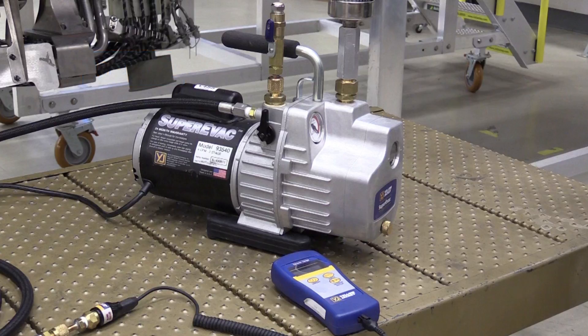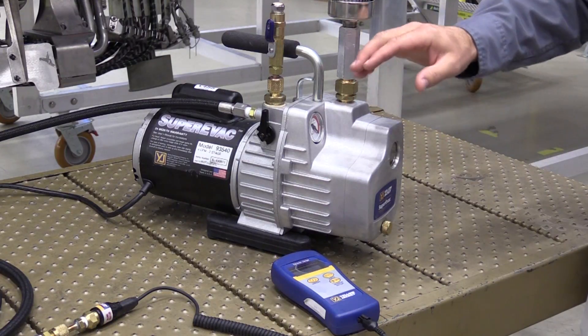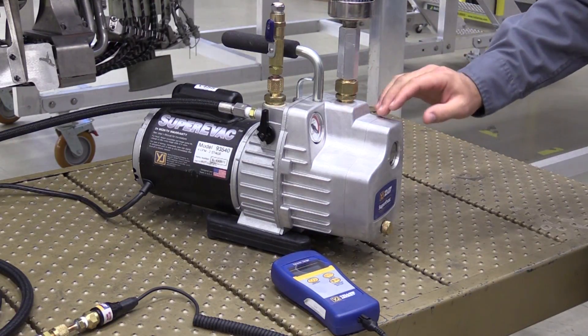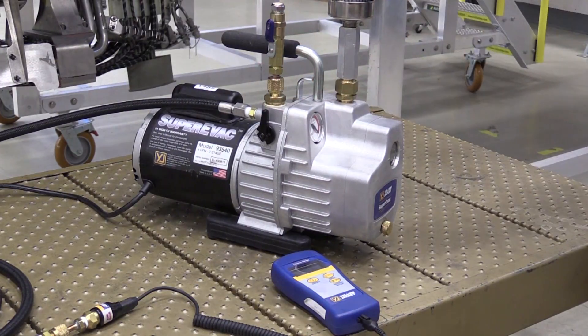To further explain the vacuum pump and how it works, we've connected the vacuum pump gauge to a hose that connects from the pump to the EEC PS3 port. This is for demonstration purposes only. The vacuum gauge is not part of the kit and is not required to complete this task. Prior to starting the pump, ensure both the blank off valve shown on the bottom of the pump and the pump relief valve on the top are in the open or vertical position.